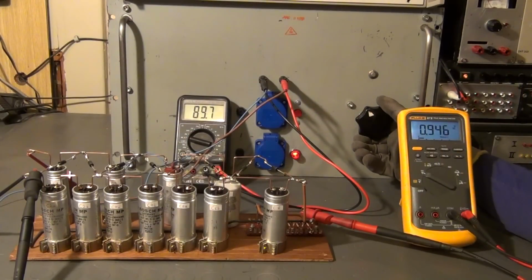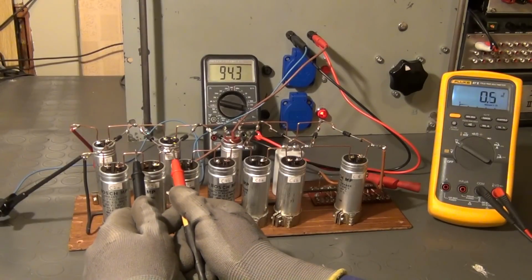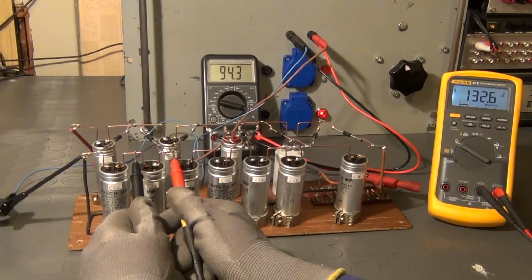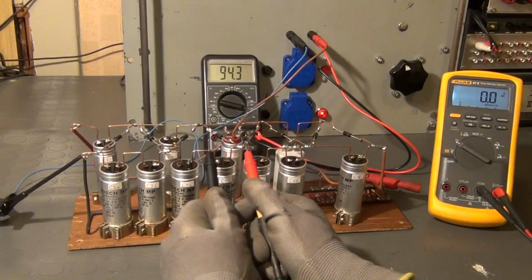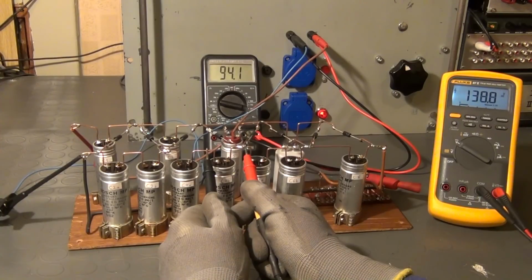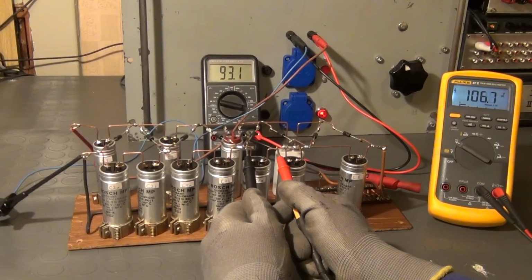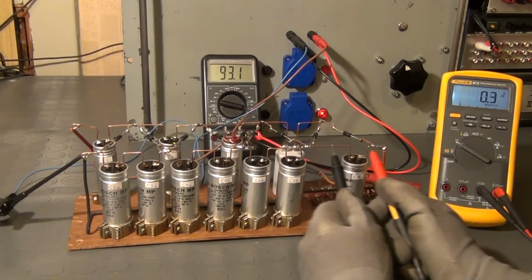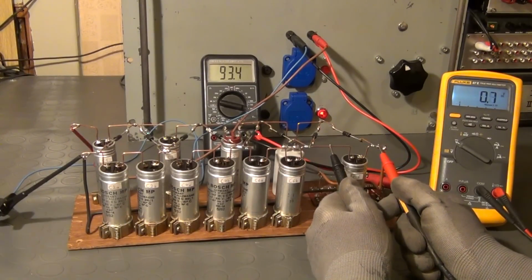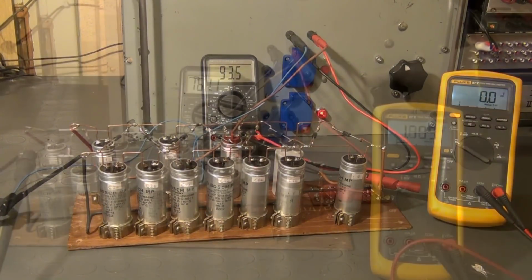Now I crank up the output voltage to 1 kilovolt. If you sum these values up, you come to a value of around 990 volts, which is close enough to the expected value. The individual values, however, deviated quite a bit from the expected values, partially as much as 20 volts. One reason more not to go any further than 2 kilovolts output voltage.